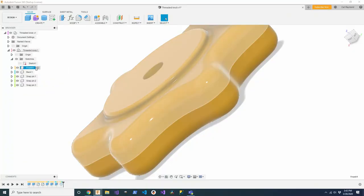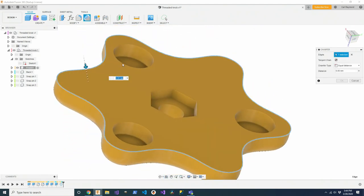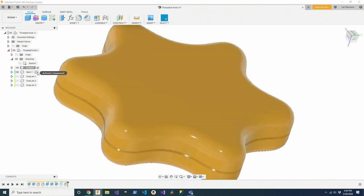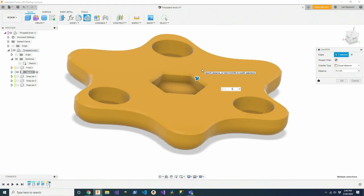I'll do the chamfering separately on each part. Working only on the front, I pick chamfer, look at the bottom face, pick the outer perimeter — and I want there to be some surface for the pin to grab onto — so I put a 0.5mm chamfer around the outside edge and around the hex hole, and that center hole as well. Then I come back onto the backside and do pretty much the same thing: six sides of the hex and the outer perimeter all get 0.5mm.